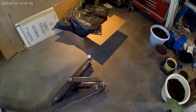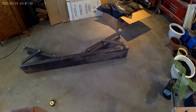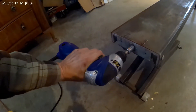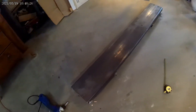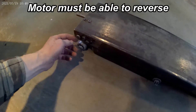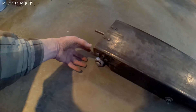This is where I was mounting the motor, with the gears here. The criteria was that it had to fit underneath a car, so it had to be about this size — very difficult to find a motor that small. I needed maybe a half to one horsepower motor, and then the gearing from the motor to the drive rod also had to be compact, which was a big problem on the mechanical side.